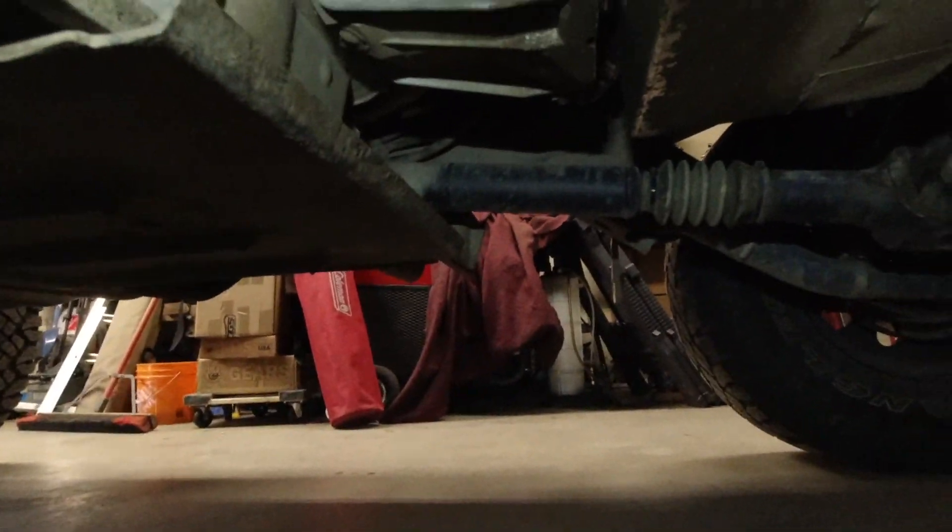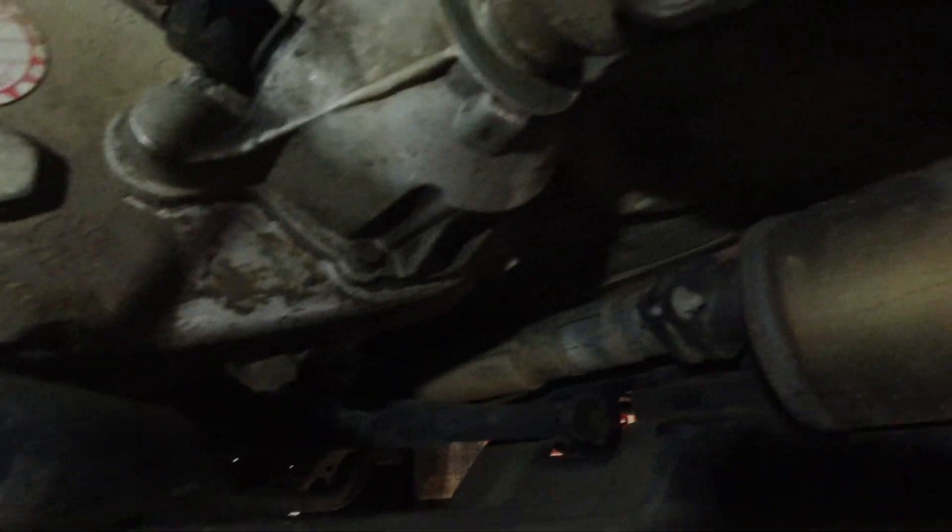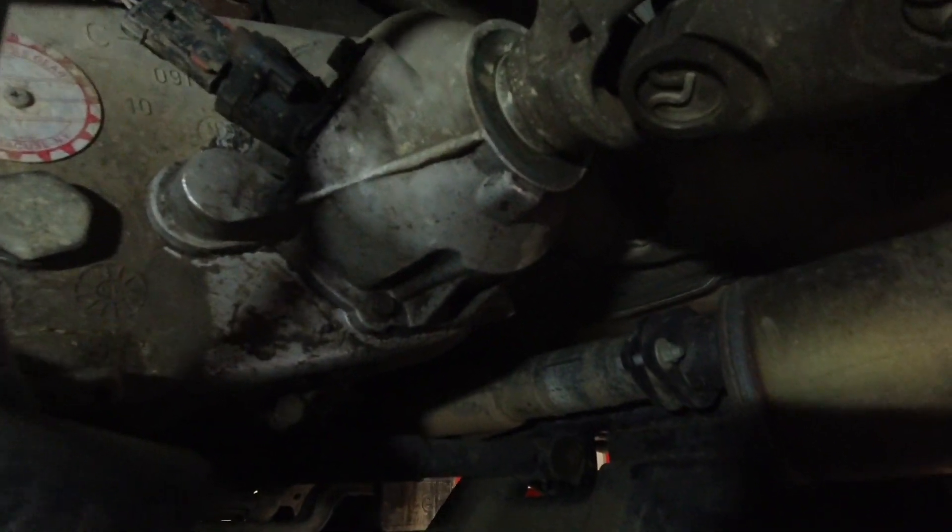Now is the time to have a look underneath for damage. There's lots of gap between the skid plate and the transmission pan, even for the back. I might have to look at getting new bolts and shortening that up. On second thought, it looks like the front drive shaft hit the exhaust a few times and put a big dent. I kind of had a feeling that was going to happen because it's so tight and so close. I'm going to have to figure something else out for that. Doing the inspection at the back — seal still holding out good, not leaking. No more issues with the fuel lines at the rear, because that was a big problem.